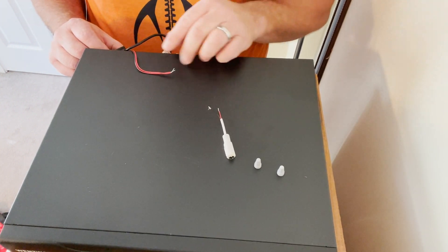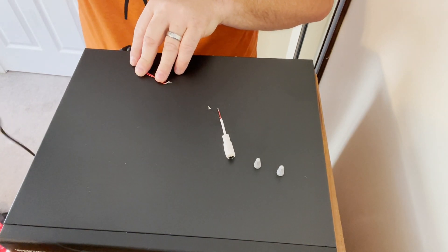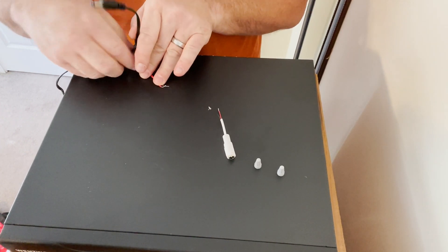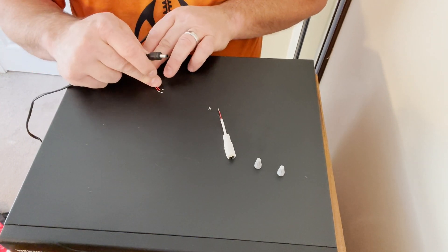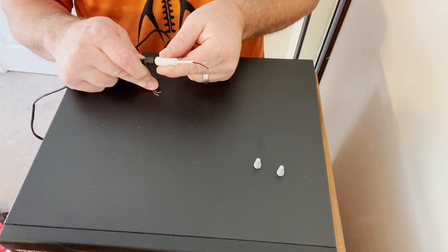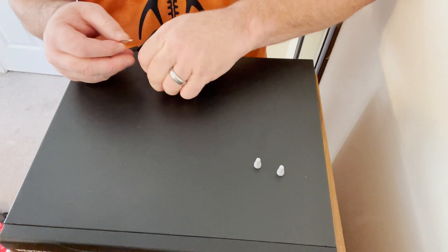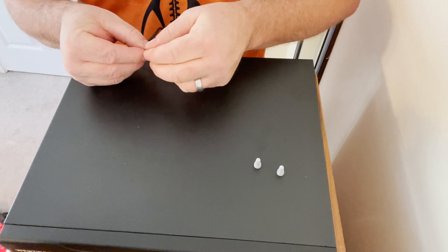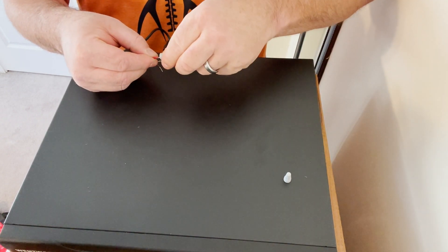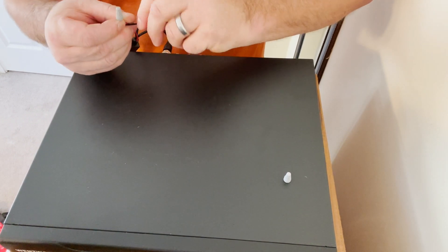You could have a single-camera power supply with a male pigtail — part number is in the description. You plug that into the wall, and the male pigtail from the power supply plugs into a female power lead — part number also in the description. You then do the same thing we did on the other end: red to red, black to black, using twist-on connectors. This is the approach for a DIY or small business install using an individual transformer to power the camera.